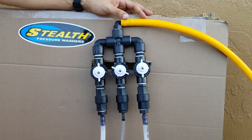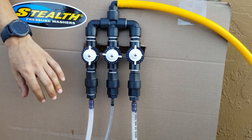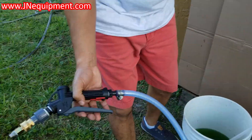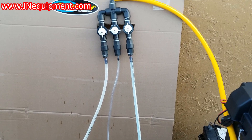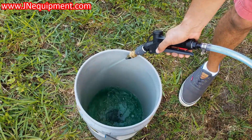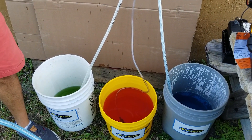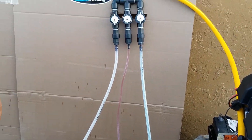Now let's fire it up and see it in action. I'm going to do a 50-50 mix and keep my surfactant line off. I'm flipping on my diaphragm pump and pulling the trigger to start priming it — we're going to see these fill up with some liquid. There we go — the two lines immediately drew, and now that I'm primed up I'm seeing my mix coming into the bucket. I'm not getting any separation. Right now I'm doing a 50-50 mix of water and bleach, even though this is just an example with blue and green water. Now I'm going to open up my soap line to number three and pull the trigger — and there you see my soap immediately got drawn into the mix.